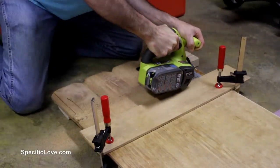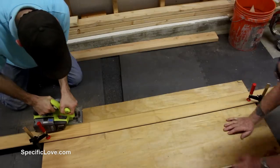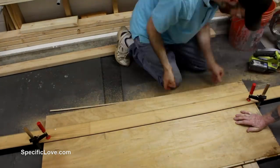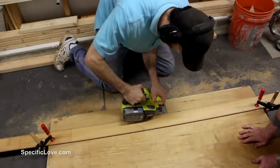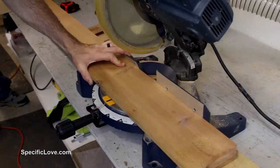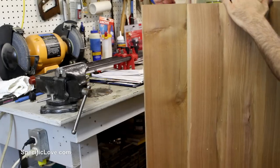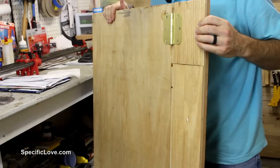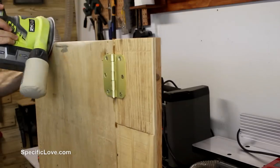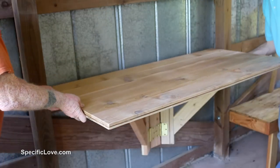Moving back to the table top, I used a straight piece of quarter-inch plywood as a guide to trim off both ends with a circular saw. For the long sides I had to use a strip of wall trim instead of plywood — it's a good idea to have an extra pair of hands for this, and I was happy to have my father help. I then trimmed the last cedar post to length as well. To hold the two sections together, I used a door hinge on the underside outside edges so the arms can clear the hinges. I went over all the outside edges with a sander to smooth and remove any rough or sharp pieces. My father then helped with a quick test fit and everything lined up as planned.